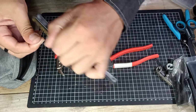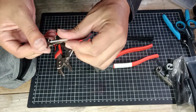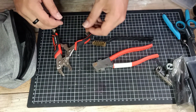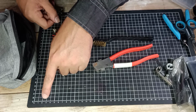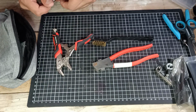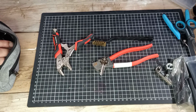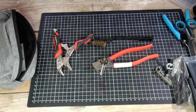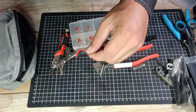I think it might just be off max at the last cut. I think from 7 to 2 is too many. Yeah, from 7 to 2. Oh, it's right in. There's meant to be 4 cuts for LW4s. There's a maximum adjacent cut. So what I'm going to do now, just to double check, this is something I always do. I'm going to grab my, I don't actually have one in here, do I? No. I'm going to grab my decoding card and I'm going to grab a core with some pins just to make sure it all works nice and smooth. So I'll pause this, grab the stuff and we'll be back.